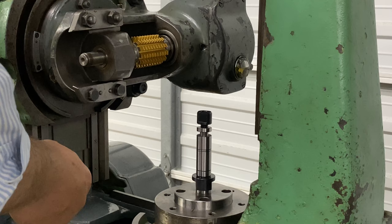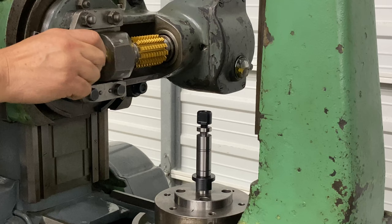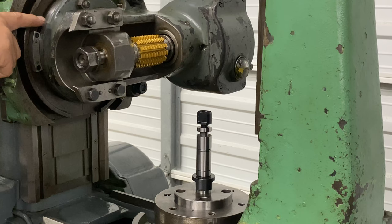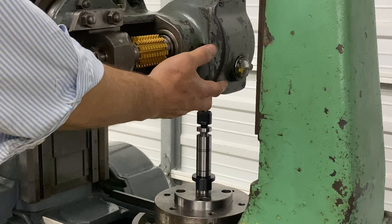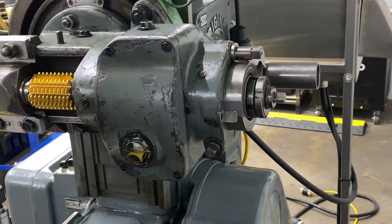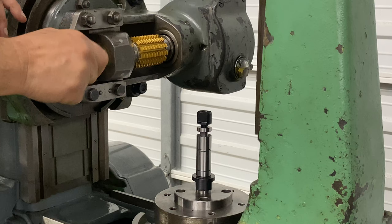We got a little space here now — all this needs to be lubricated pretty good. There's lots of little lubrication points. The cavity inside here has that spiral bevel gear, two of them at 90 degrees from each other. This reflects the oil that's in that cavity made between the hob head and the machine. On the other side, there's another cavity with another sight glass that lubricates a rather large reduction gear on that side. All of it is to get the transmission 40 to 1 and machine constant 8 all set up so it works just fine. This is getting really close and ready to go.